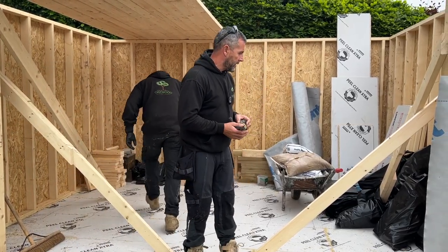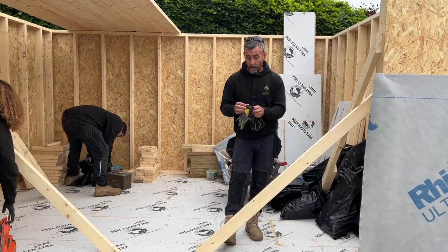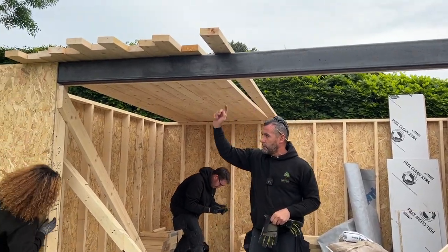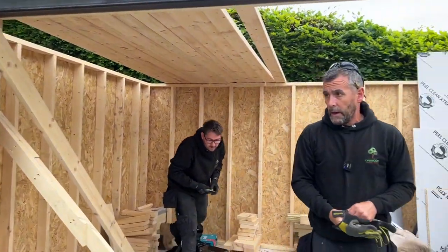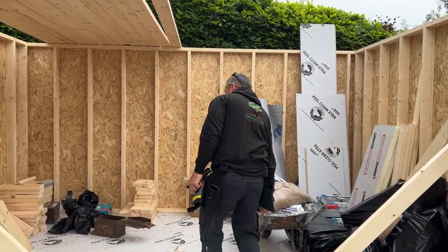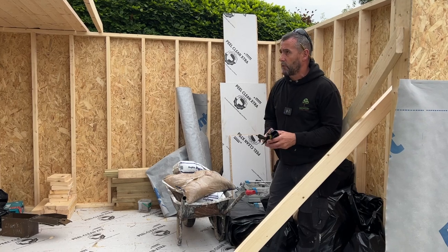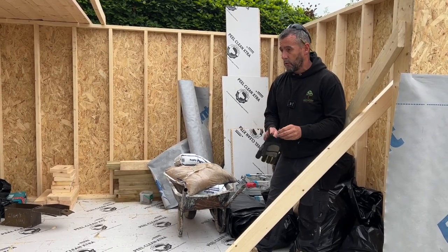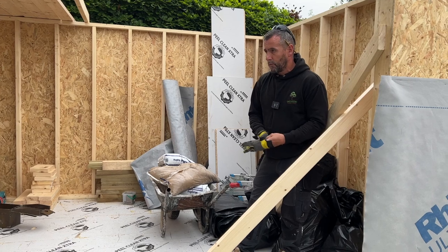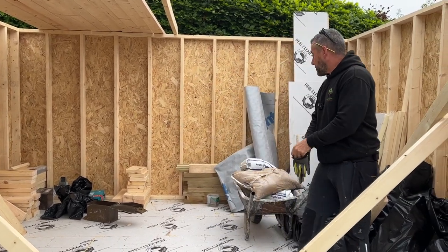It's Day 5, Friday. Combined, we got rained off Tuesday and went home early another day. We're going to get the roof on today. We've already pre-cut the 5x2s to length. We're doing a hybrid roof because we're limited to 2.5m height under permitted development, so we're restricted on timber sizes. It's a low-occupancy room so it's not an issue — there's been a report done on it. It's your decision on roof type, but at 2.5m you're very limited.